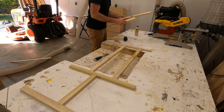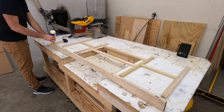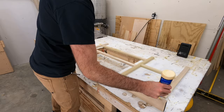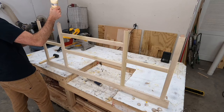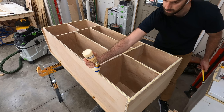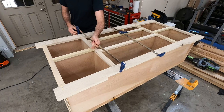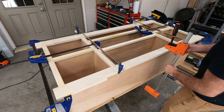With that bottom piece trimmed, I went ahead and assembled the face frame. There are a number of different ways to do this — I'm using dominoes, but you can also use pocket holes or dowels. I put the domino on the loose joinery setting so that if maybe I didn't have a board lined up perfectly with a shelf, I could just tap it one way or the other to make sure everything lined up before clamping it down.